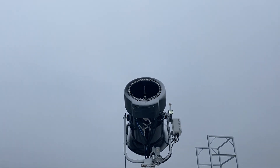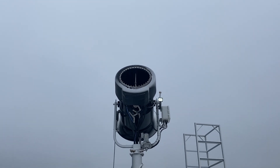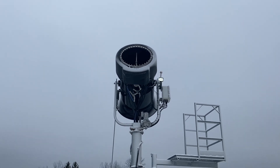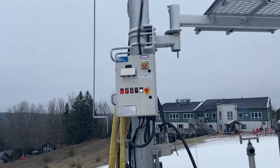What that does is, in the center — you can see the fan there — dead center there's what's called a nucleator. It's spraying compressed air out, helping break up the water particles, and also as the compressed air expands it actually cools the water.